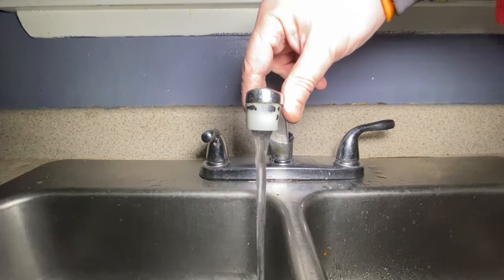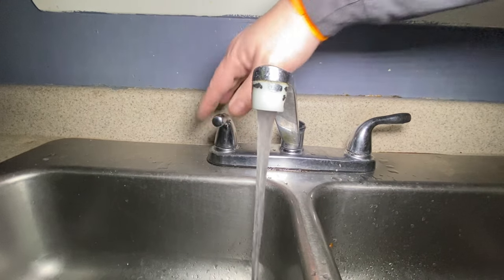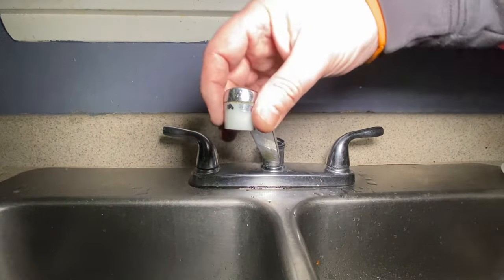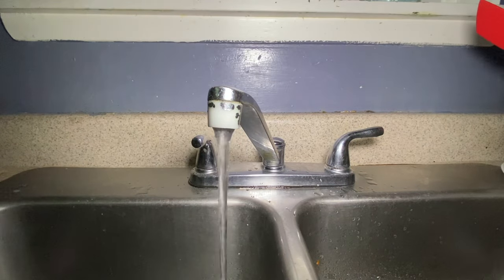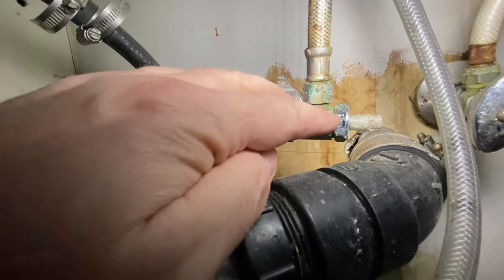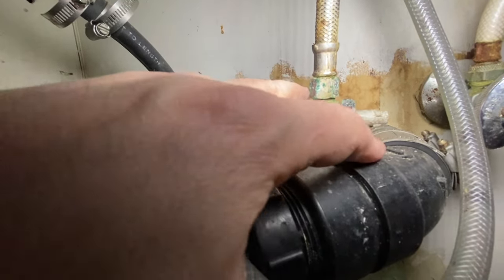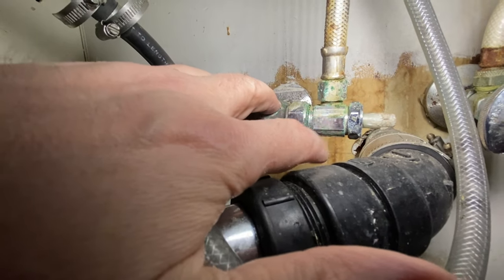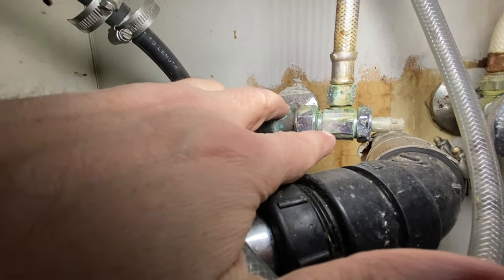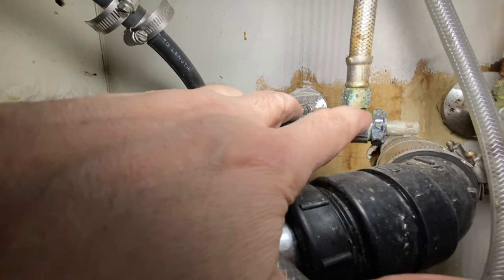So it's shut off now, but we don't get a lot of hot water on this side — now we have a different problem. This hot water shutoff valve underneath the sink, this angle stop — one, you can't actually get a good shutoff on it without putting pliers to it because there's a drain line in the way. And two, I actually think that the seal that shuts this off is gone, and it's probably blocking this valve and not allowing water to come to the faucet the way it should — or it's gone up to the faucet and completely clogged it. We might have to take that apart again. But they've got hot water for right now, we've stopped the drip, and this is a video for another day.